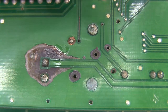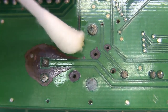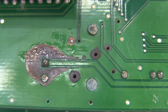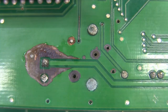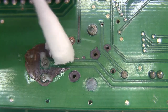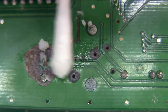Sorry, I bumped my camera, so it's wobbling just a little bit. You're going to come in here and clean those areas that had that green stuff on them with this vinegar — that'll get off the last little bit of residue. But now you don't want to leave that acid on there, so we're going to take a little bit of baking soda. Take your Q-tip, dip it in water, then dip it in baking soda, and clean these areas with baking soda. That neutralizes the acid.